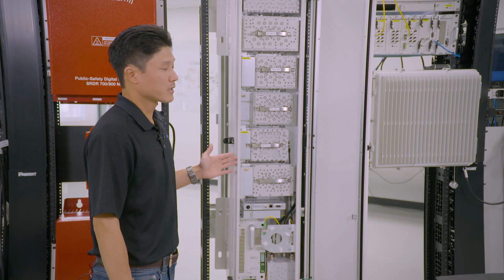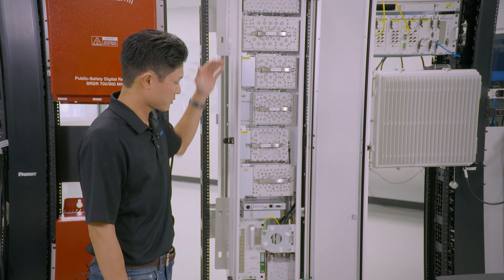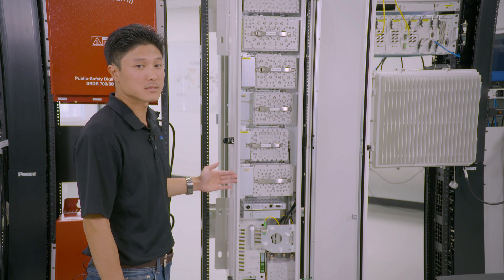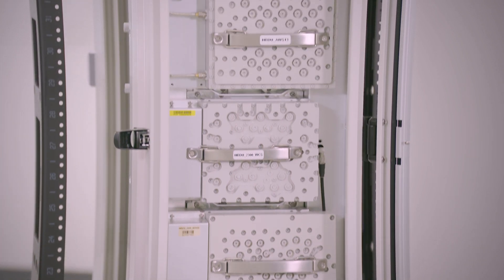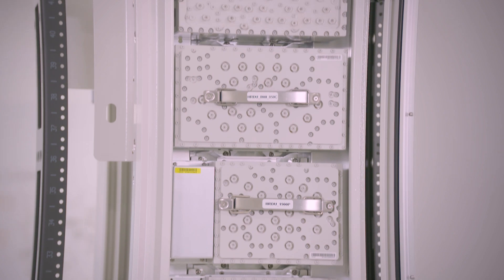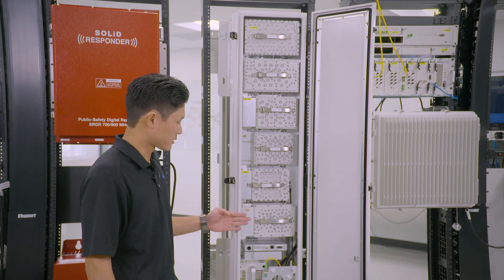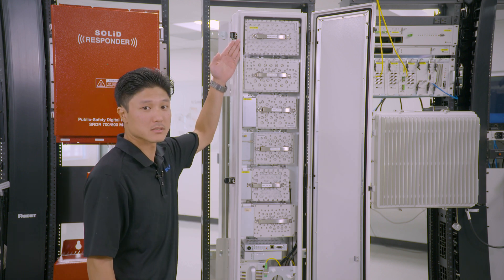Here's our MPROU. It covers all seven cellular bands from 600 to 2500. All amplifiers are 20 watts except for the 600 and 700, which are 5 watts each. The MPROU is fully modular with the highest frequency amplifier being installed in slot 1 to the lowest frequency amplifier being installed in slot 6.